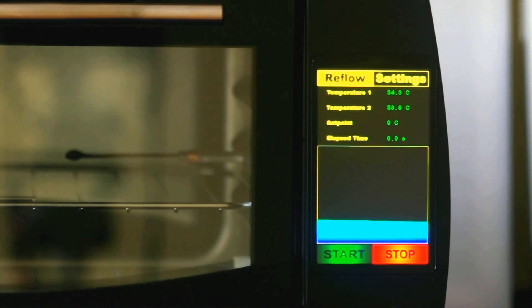This project uses a capacitive touch screen from the HTC Desire phone. It can track two fingers, and it uses the I2C protocol to get data. One line is used for interrupts. I don't have to use a lot of pressure to get the touch point coordinates from the screen.